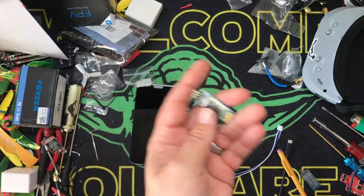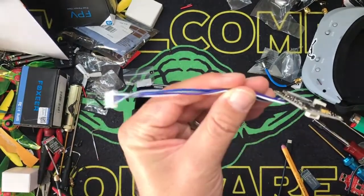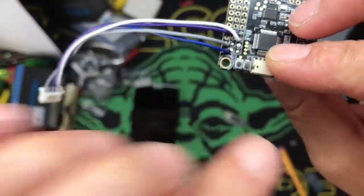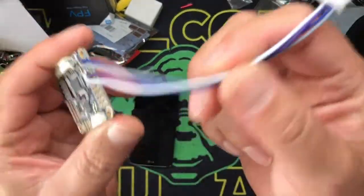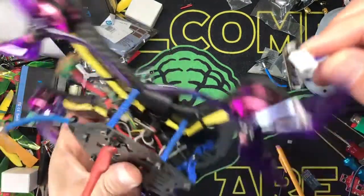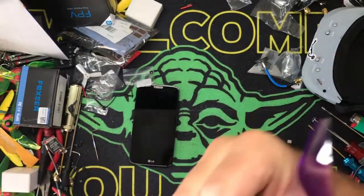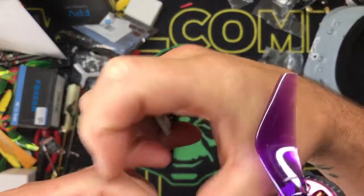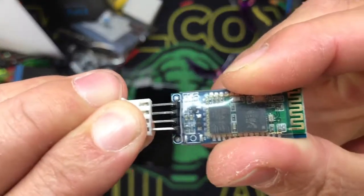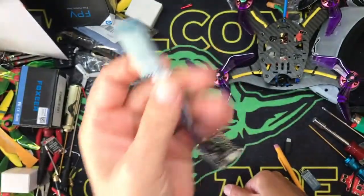Here's my thinking: instead of installing this permanently, I have like 28 birds between quadcopters, minis, and drones. I'm gonna buy 3S battery balance plugs, wire them into your control board on UART 1 or 2, and make the wires really long then shorten them up. I'm actually gonna mount this little socket right underneath the frame - then all I ever have to do is plug this in like a socket. Bang - Bluetooth enabled. Boot up your bird and you're done.